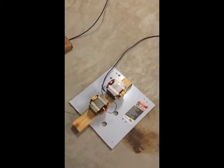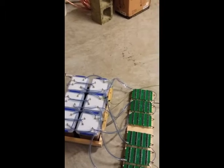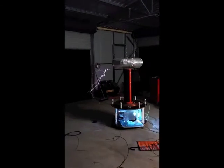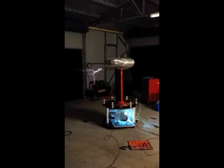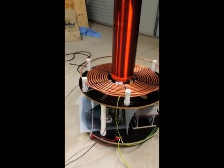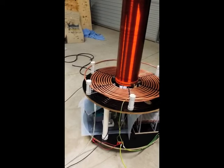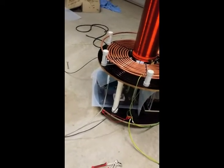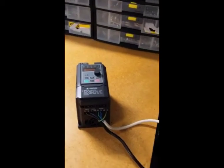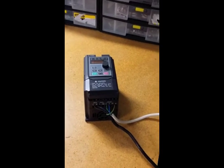This is far too big for the kind of power I'm hoping to run. 12 Henrys is a bit large, but I just threw it together today and it's all going well. And there goes the VFD again. As you can see, it ran pretty well. Unfortunately the variable frequency drive for that little three phase motor is getting some interference or something and shutting down. But fortunately it's not destroying it — it's just causing some kind of error. So hopefully if I get that housed in a grounded box, it'll work.